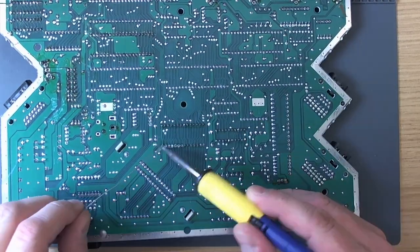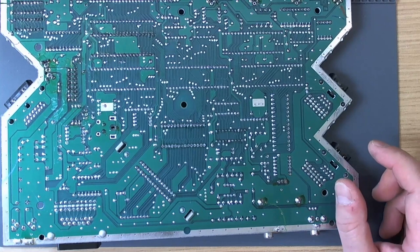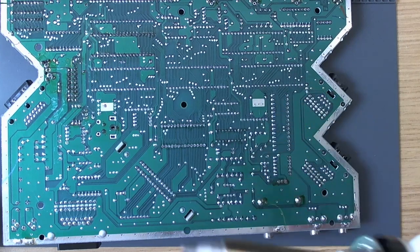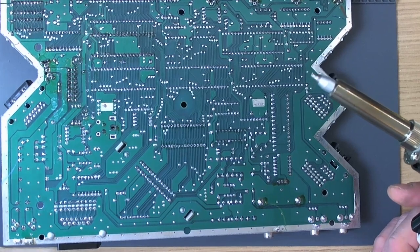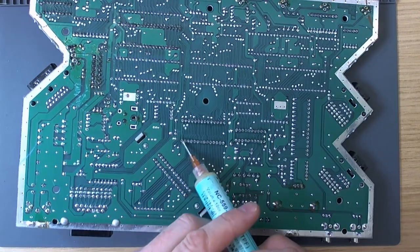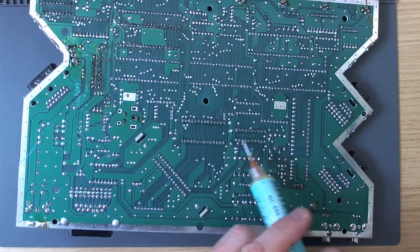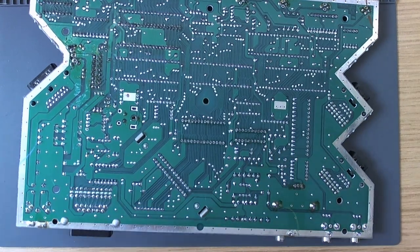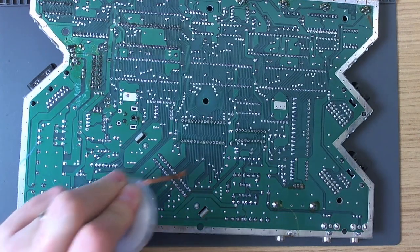Oh yes, that's better. For those of you waiting for Side Three and wondering why I'm doing this instead of finishing the firmware — that's exactly what I was doing until I got stuck with something regarding SpartaDOS X, and I'm waiting for Campbell to answer his messages. Right, I'll do the same thing I did last time because it seemed to work out quite well: go over the back side of the chip with some flux and wick. That seemed to release the CPU very nicely, so let's see if we can have the same luck with these ones.